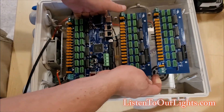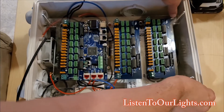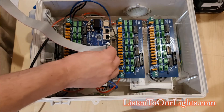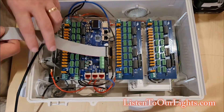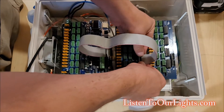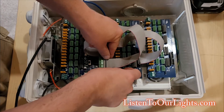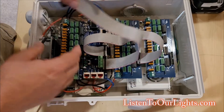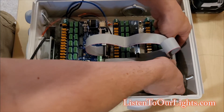And then this sits like that. So I connect the 24-pin ribbon cable — this says expansion one. I push it down gently, evenly. You've got to be careful with ribbon cables. And I run this to my first expansion board. This one goes into expansion port number two. Again, even pressure, a little bit of rocking, get a good seat. And we plug it into the second expansion port.